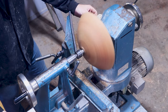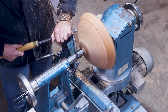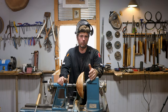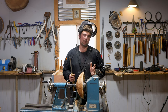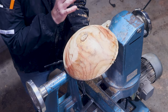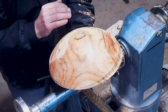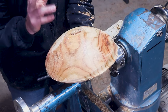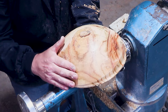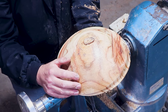Bring up the speed and do a pull cut. That's quite a safe way to do it — just make sure everything is locked off and safe. You can see there where I've removed the sheen — that was the wood glue from the end grain. I've shaved that side off but I've still got enough material there. That's why balancing your bowls and making them spin true is really important to not waste our precious resource.